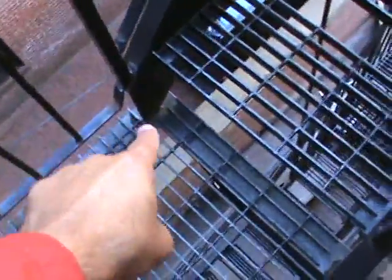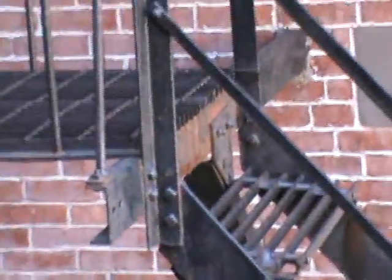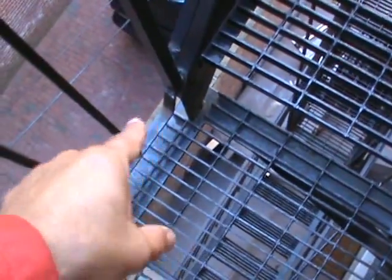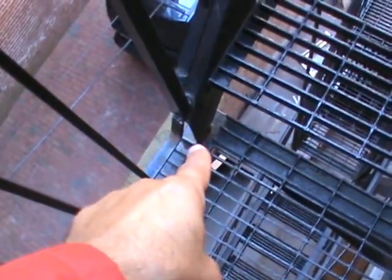Then the welded connection, see the weld down there? As soon as you pop in a bolt down there, you start eliminating the need for x-rays. See, welded connections there. So the water's definitely pooling, getting underneath these. And that's the beauty of bolted connections. As you can see there, all these bolted connections allow this thing to breathe, but when you weld them, it's a frozen connection, and they start tearing and ripping and opening, and then the water gets in there on both of these.